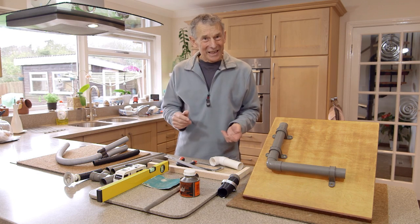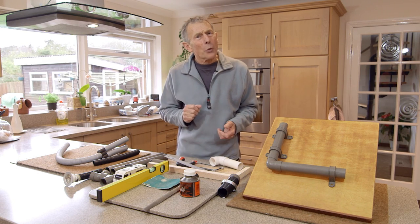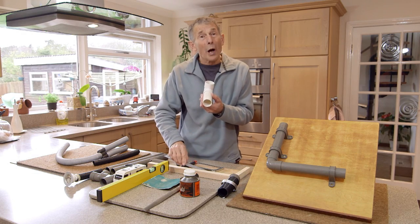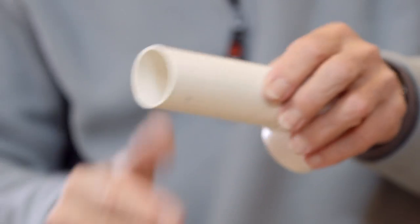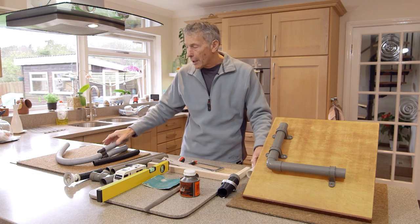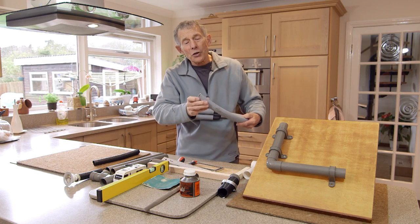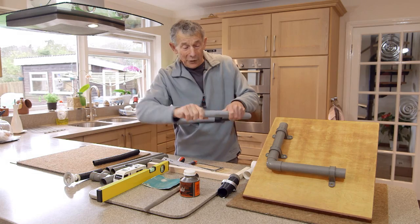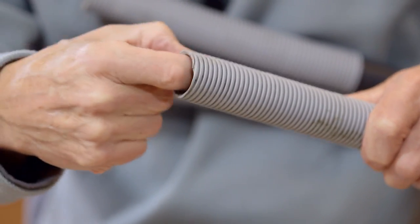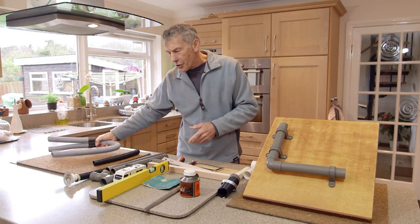Yes, I think it can, but first let's check one or two points. On a domestic system it has the advantage of big wide-bore pipe — used to be called inch and a half — smooth on the inside, but too big for a caravan. In caravans they fit this cheaper flexy stuff, but unfortunately it has ridges on the inside which slow down water and trap things as well.